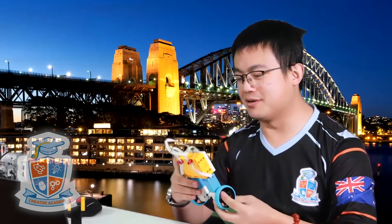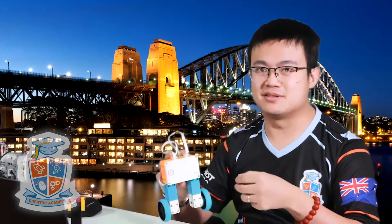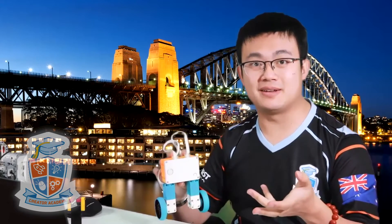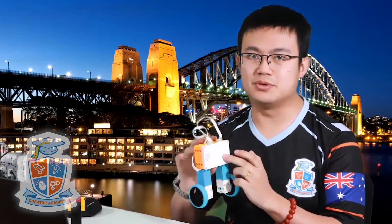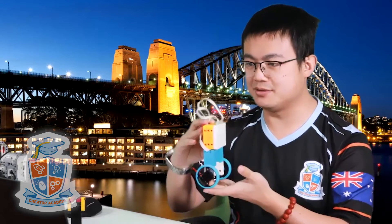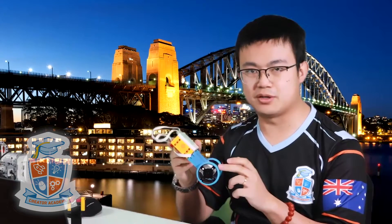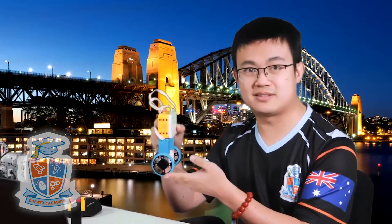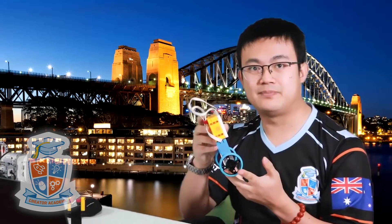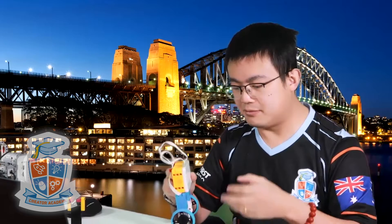So now that we've built Gyro Girl, let's talk a little bit about the pseudocode. What are we trying to do to balance this robot? You can think about it as a few different layers. At the very simplest, we are using the onboard gyroscope. What we want is that when the robot is tilting over this way, we rotate the motors that way - to move the wheels under where it's falling. And when it's tilting the other way, we rotate the wheels back towards where it's falling.